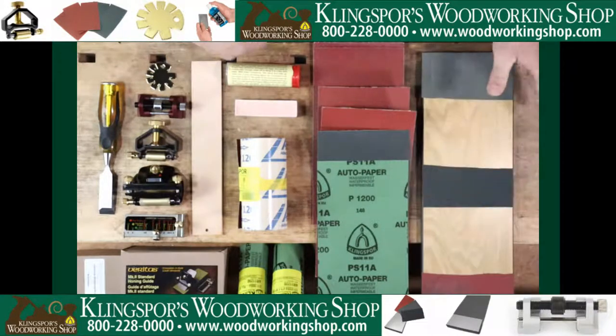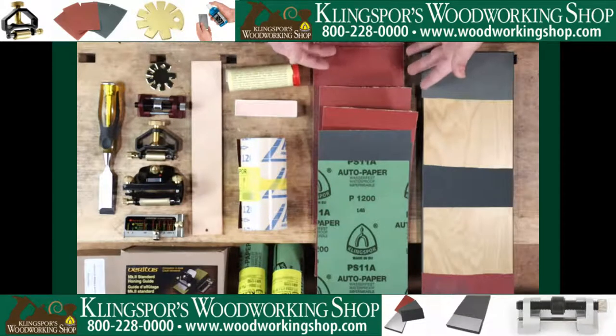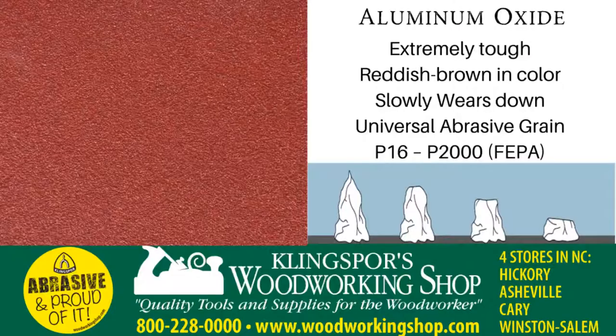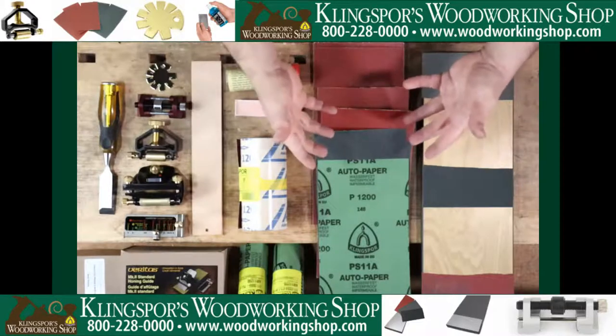With the block or without, you're getting aluminum oxide in your 80 and 120. The benefits of aluminum oxide: it's a tough, hard grain, very durable, holds up well to metal. As it wears, it starts sharp but becomes more blunt over time — it doesn't change grits, it just doesn't sand as well. Silicon carbide, on the other hand, is a very sharp grain — actually the hardest apart from diamond — and it goes through a process called friability, meaning as you use it, it fractures off exposing new fresh grain, so you're always left with a very sharp edge until you get to the backing.